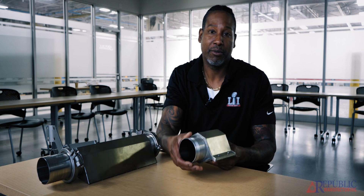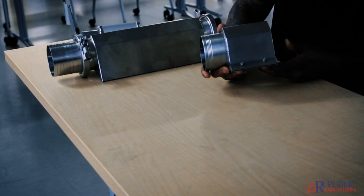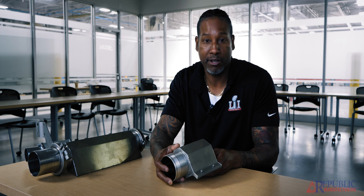The next one we want to talk about is our stainless steel air knife, which is 304 stainless. This particular air knife is made for your caustic wash environments — whether it's caustic soap or battery drying with acid, this would be the material you'd want to use for your air knife.